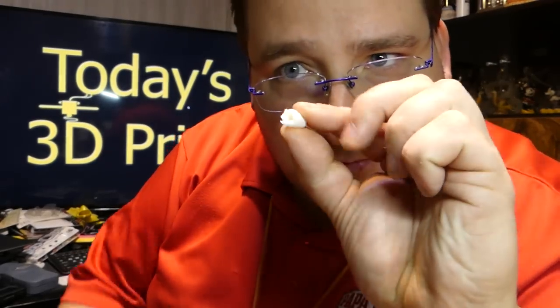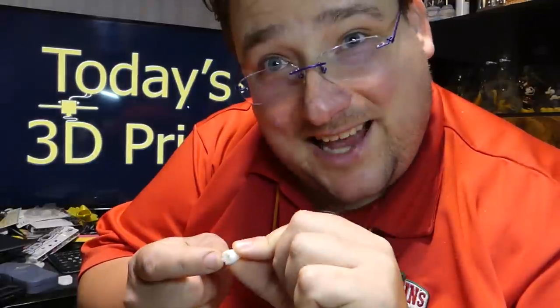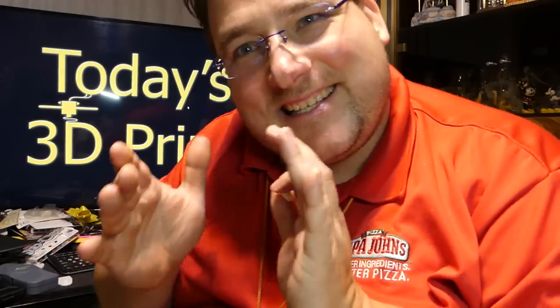But what happens if I pull back 1 millimeter and then push forward 0.55 millimeters and then only push 0.2 millimeters of plastic? Well, I never got back to zero before I hit my next 1 millimeter retract, 0.55 millimeter restart. So in the end, because each of the nubs of the spiral is less than 0.45 millimeters of plastic, you actually never get back to zero. Your commands are actually causing it to pull the filament out of the printer instead of pushing filament into the printer, because your grand total number of retracts exceeds your grand total number of extrusions.